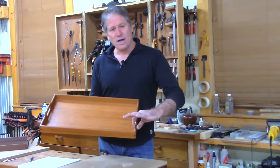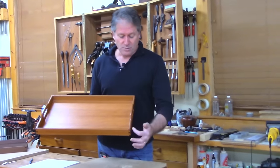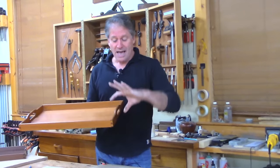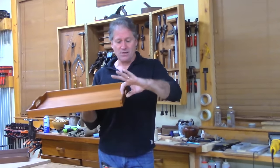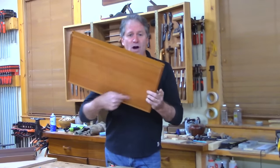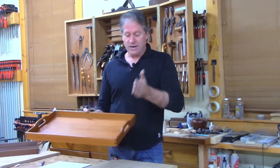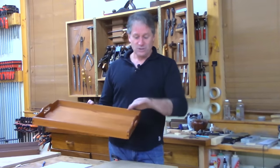They wanted the sides thinner as well, which presented a problem. These sides are pretty thin as it is — they're 7/16 thick — and if you go much thinner you're going to have a very light corner on a miter. So I decided to start with 7/16 thick material and taper the inside so it came up to leave a 5/16 thickness on the top. That way it would be heavy enough to accept a groove for the bottom panel, but look cleaner and lighter at the top. That angle also led me to design a rolled-out handle.